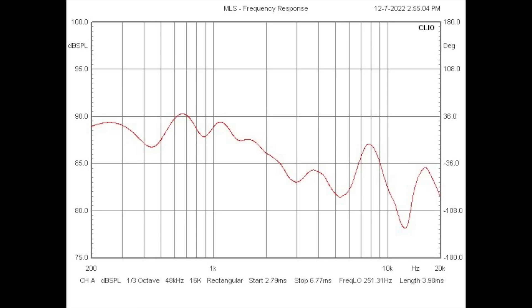The company is called Monoprice and they've come out with this new line called the Monoliths. This isn't the first model I've had in from Monoprice. They originally sent in a Monolith called a KBAS model — a woofer and a tweeter underneath — and it measured really poorly. Looking at the frequency response, it was rough, and if you moved up or down it got even worse. There was some stored energy in the woofer's response and the tweeter level was so far down I felt like something might be wrong with it — the tweeter may just be bad. I told the customer we can't fix this, contact the manufacturer, see if the driver's bad, send it back. Wasn't impressed at all.